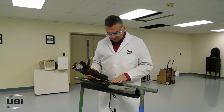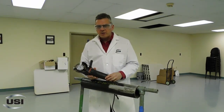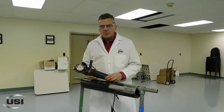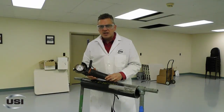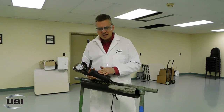This is basically a steel pipe, and today we want to provide some training on a popular tool for when you can't afford to blast because you're concerned about combustible gases, or perhaps it's just too small of an area to bring out your blast pot and your rig, or you just need a good safe way of blasting. I just got a phone call from a guy that's going to be coating the inside of a 36-inch weld, and being inside the pipe there's no real good way to get blast media in there, so he's going to be using a bristle blaster.